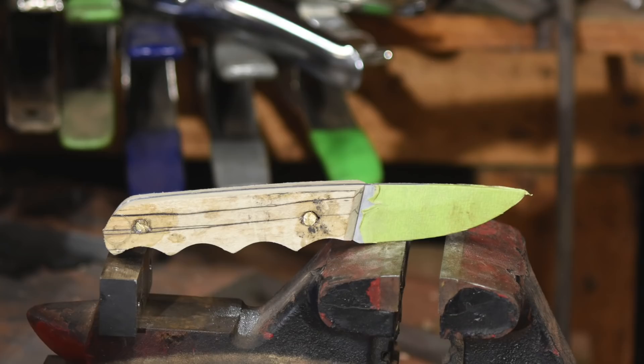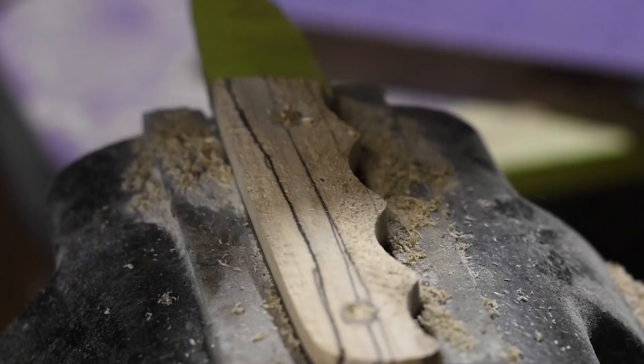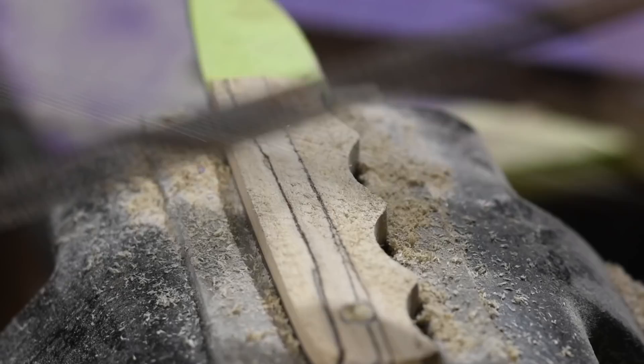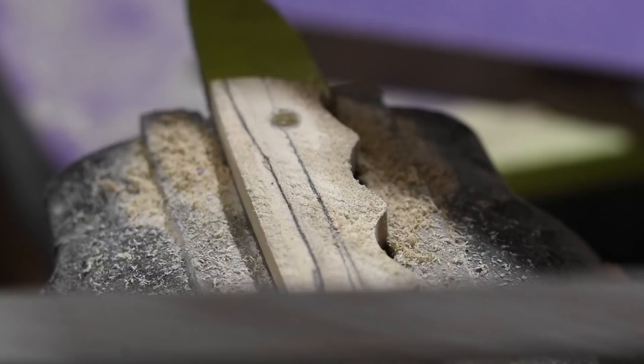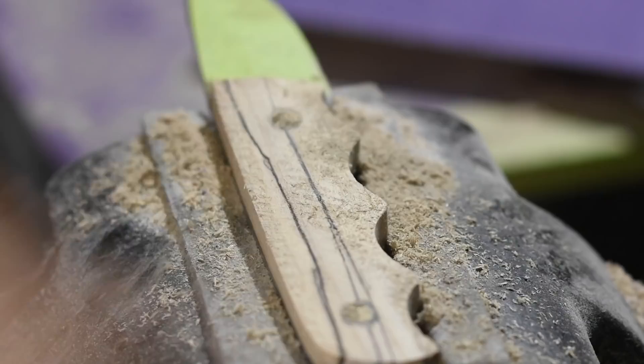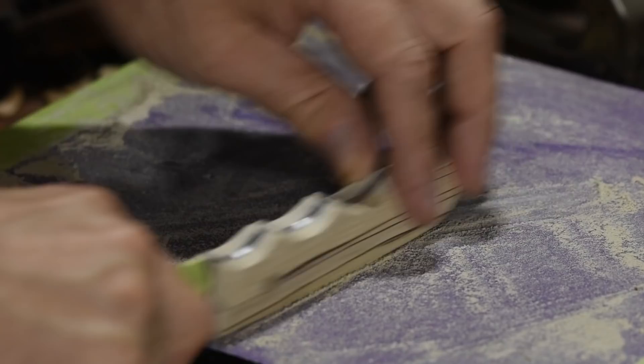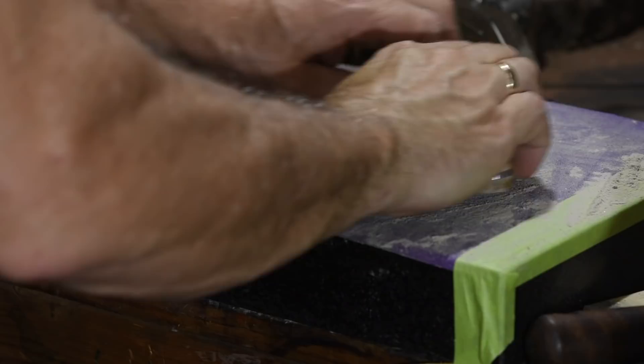You can do this however you want — flat, rounded, thin, fat, whatever. Everybody has different taste in handles. In this case, I'll be giving the handle a rounded profile, which is kind of what I like in a knife this size. The rasp hogs off most of the wood, then you can work the pins down with the file. Now back to the flat surface and 60-grit sandpaper again to finish radiusing the sides. You can run up through whatever floats your boat — 120, 220, 320 — then finish by hand sanding with 600 grit.